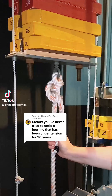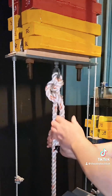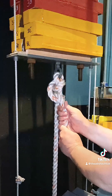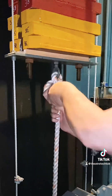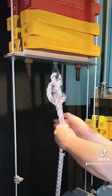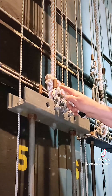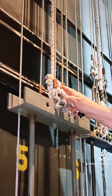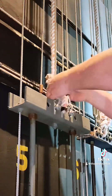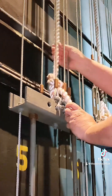We got a lot of people championing the bowline and a lot of people championing an eye splice, but they're just not the right knots for this application. I challenge you to loosen up a splice or a bowline while it's under tension — you just can't do that. Here we have a bowline, and I challenge anyone to undo that bowline while it's under tension. It is just nearly impossible unless you have mechanical means. You can use a marlin spike to free it up if it's too tight, but I can't feed this tail through and release that bowline at all because it's under tension.